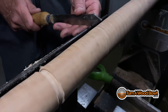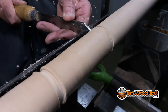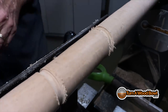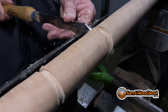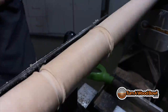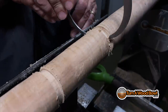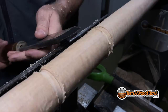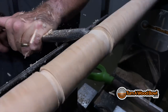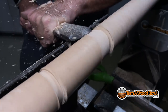I could check with the calipers while the piece is turning, but my calipers aren't ground down and I'm just not comfortable doing that, so I'm stopping the lathe to use the calipers. Now, when I'm using the parting tool I'm making what's called a peeling cut — basically shaving away the top layer of the wood as it comes around. We'll talk about that more in a second.